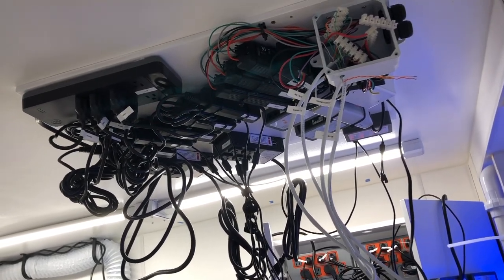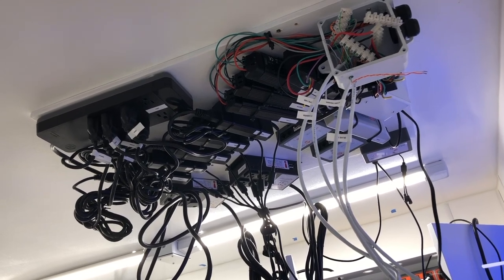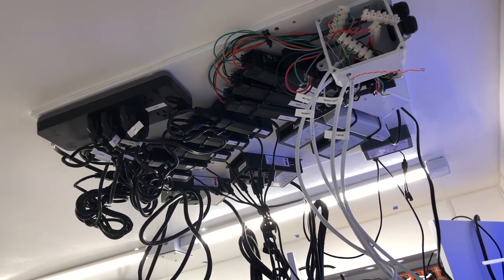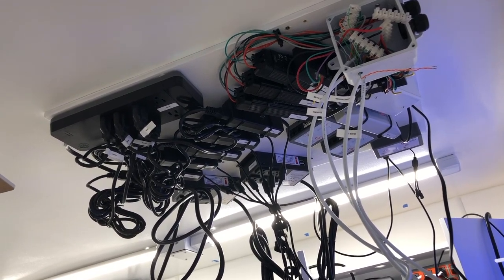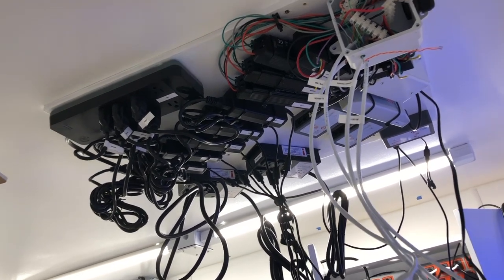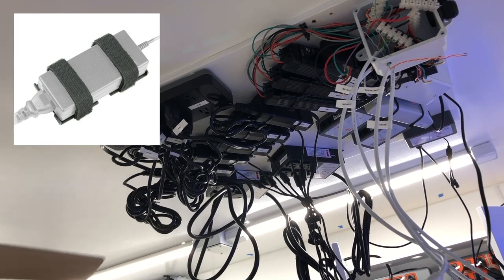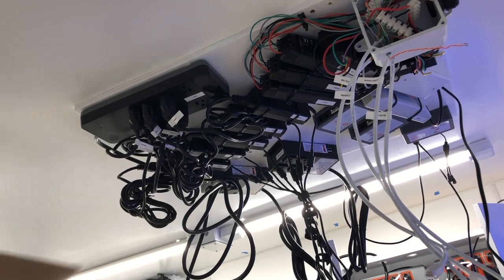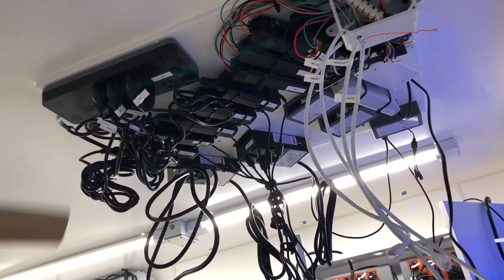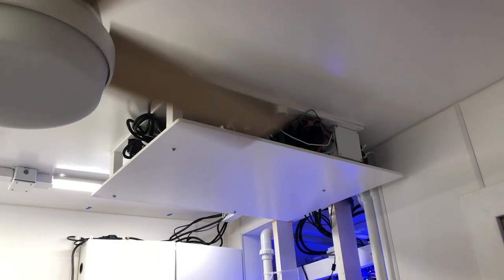The light rack is mounted to the ceiling with a little wire management still to do. Getting drivers and electronics out of the lighting hood is a big benefit — moisture and heat are what make power supplies and drivers fail prematurely. The rack is mounted at an angle so a fan in the fish room blows cool air through the power supplies. All the power supplies are mounted on edge rather than flat — that exposes more surface area to air for better cooling. With the panel attached and the fan going, hopefully this keeps everything cool.